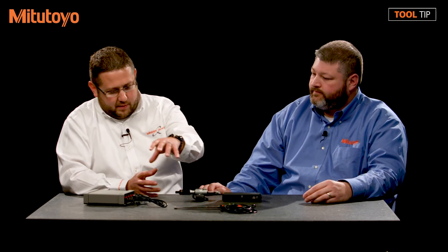This is all great for pulling data from physical measuring tools — a micrometer, indicator, or caliper — but not every tool has a Digimatic output port. Maybe the data is coming from another software like CMM software or vision software. If it's a Mitutoyo product using standard Mitutoyo software such as MCOSMOS, QVPAC, or FormTracePAC, we can use a DDE connection — a direct handshake to MeasurLink with minimal setup. You simply specify the tolerance you're sending to MeasurLink and you're off and running.